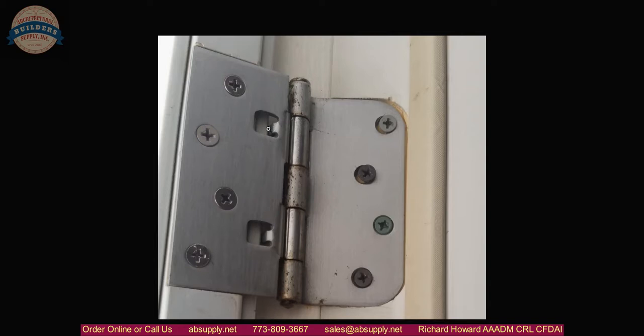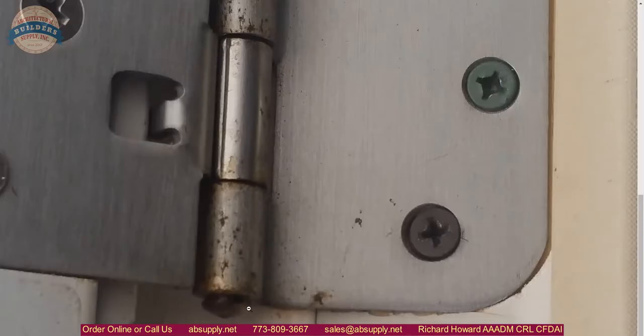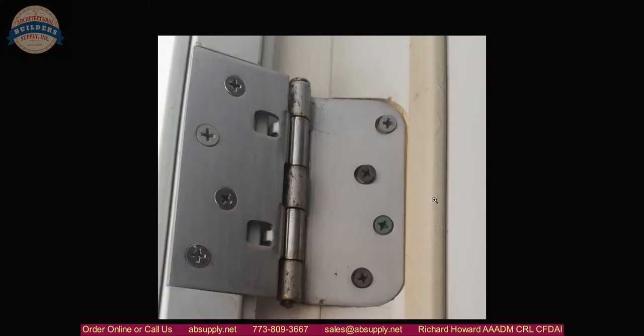You'll notice that they have these projecting prongs on the back. That is not a security measure at all — that just permits the manufacturer when assembling the hinge onto the edge of the door to position it correctly, so that this dimension is determined by flushing the hinge against the face of the door. When the door is in the closed position, if you drove that pin out — and this might be a riveted pin, as would be expected on an exterior door — you could just tip the door out. These prongs wouldn't do anything.